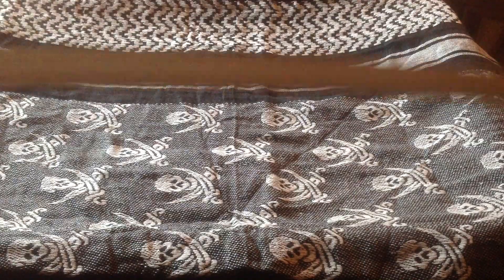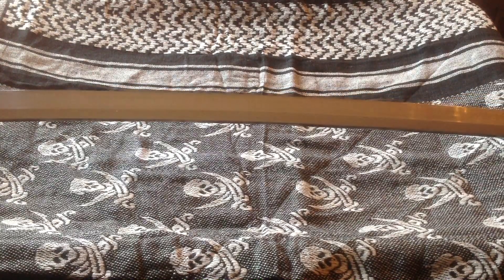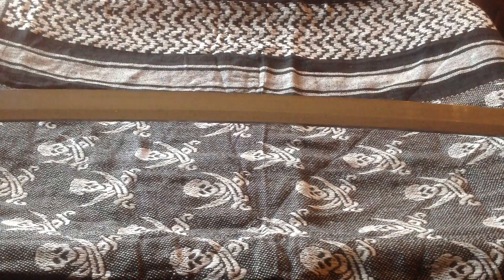The sword is two kinds of steel folded together — 1060 and 9260. It gives you a really nice grain pattern, hada to the blade. You can see there's a temper line — there's a straight hamon on it. Like I said it really reminded me of the Skudgero Forge's profile, and it still does. 26 inches is great, a nice fast little thing. Hoping it's going to take over backyard cutting duties.